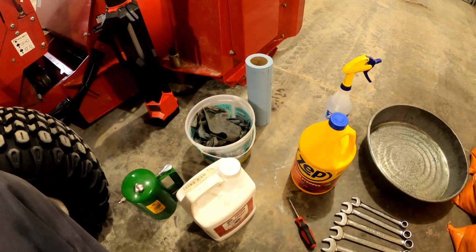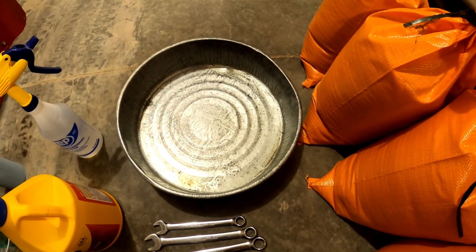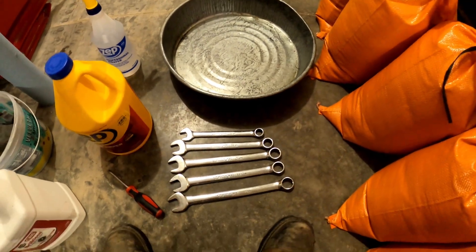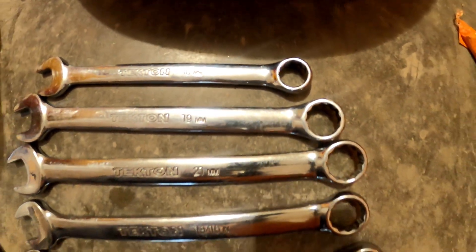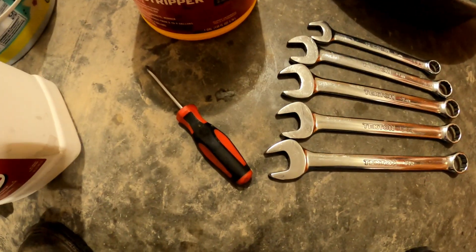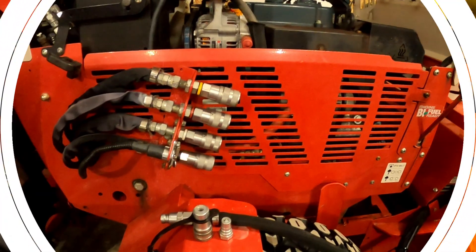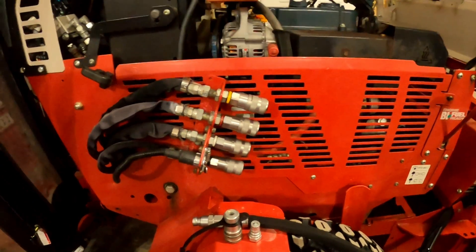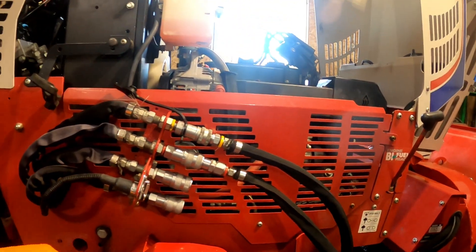However, it doesn't degrease almost instantly like brake clean does. Have some kind of pan or something to catch any oil that may get past your rag so it doesn't drip on your floors, to help with cleanup. For wrenches, I have a 16mm, 19mm, 21mm, 13/16ths, and 7/8ths, and also a flat face screwdriver to remove the plugs out of the couplers. The three reasons to consider switching to the flat face style coupler are: one — fluid loss, two — contamination, and three — cleanliness.